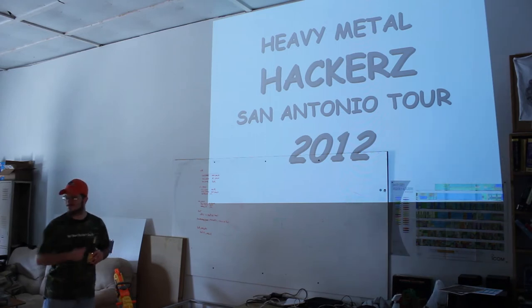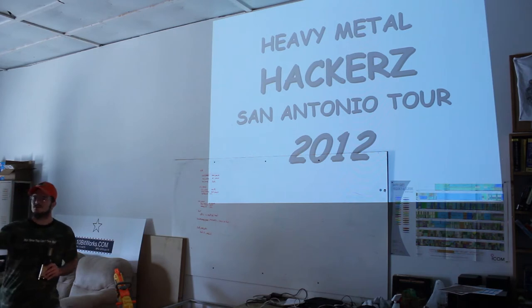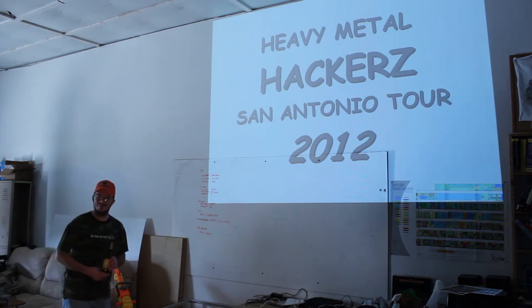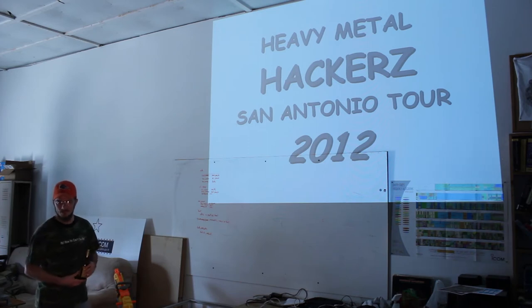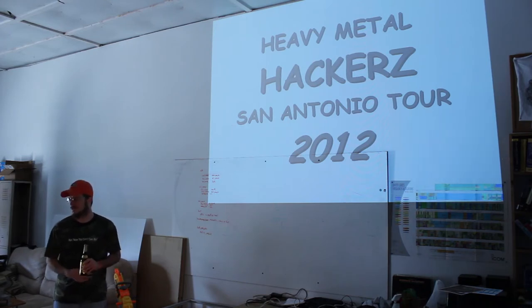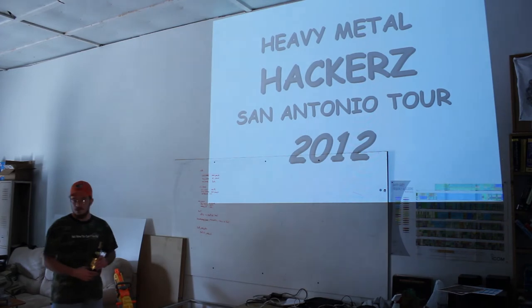What you got, Mike? You'll probably cover this later, but what's the difference between an arc welder and like Frederick's high voltage thing? Remember his screwdriver? Oh yeah, with the little fractal demonstration there. It's a real high voltage. Well, it's just a flyback transformer, basically. It just shoots out juice. The one I have is basically just a transformer. It just generates 25,000 volts at 25 kilohertz, and that's all it does. So it just puts out sparks. An arc welder is going to be high current, lower voltage. The voltages are like 10 to 20, 30 volts. That's it. But they're running really high amps, like 200 amps. So the current is what gives you the heat? Absolutely. Yes. Okay. Next slide, please.